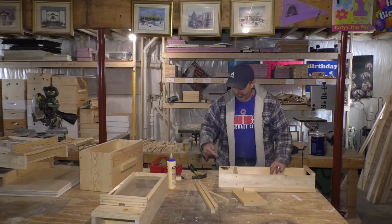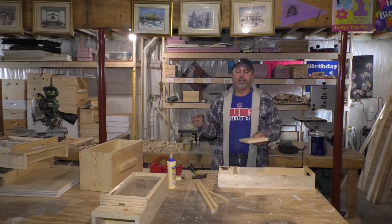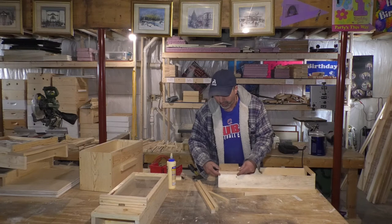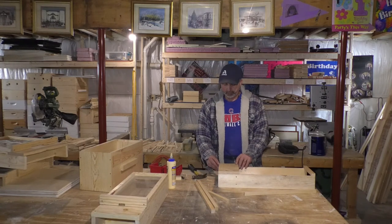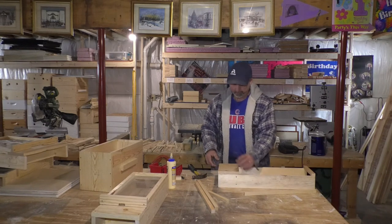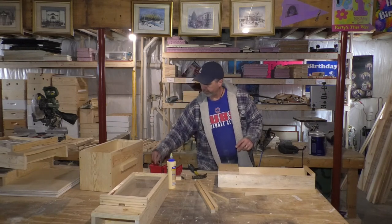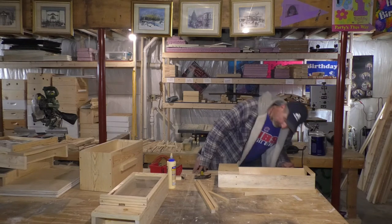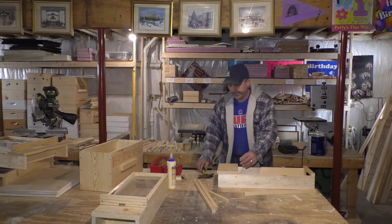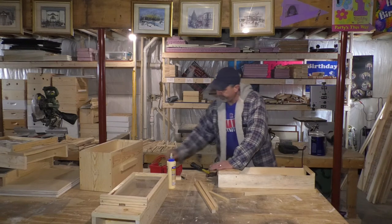There's a knot there. I'll just make sure my nail doesn't go in where that knot is. Never drive your nail into a knot, because you could split your wood, or it could bust off. Or it won't go in, period, because the knots are so hard. So this is going to sit right like that. Where's that towel at? Here again, start this one on this side here. I'm going to avoid where that knot is. Start that there.